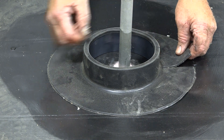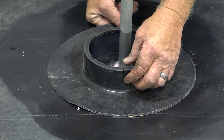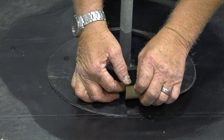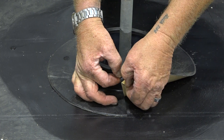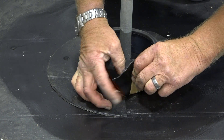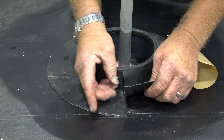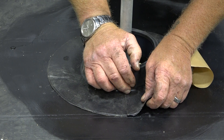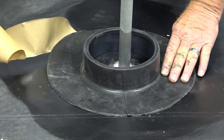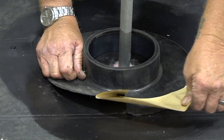These are just a peel-and-stick. You want to make sure that the seam is down in the direction of your water flow, away from it, so we're not bucking anything. Now you're going to take your release paper and pull the paper back. You want to pull that at about a 45-degree angle so it doesn't tear easily that way. Then you're just going to go ahead and work that right around to the end of it.